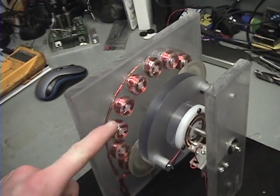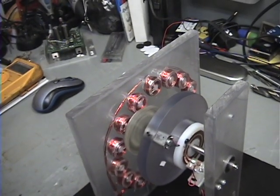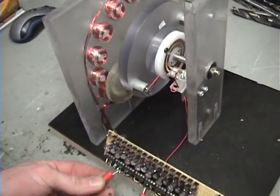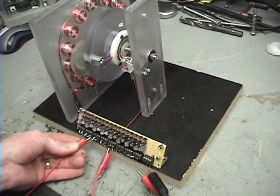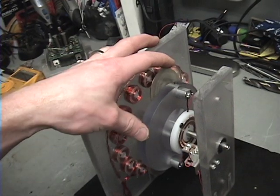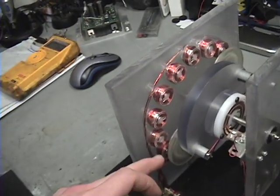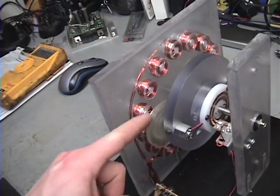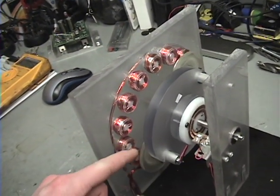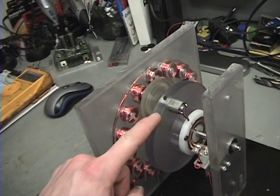Now originally when I short these coils out, this rotor would turn the way I had those magnets on there. But oddly enough, when I short these coils out — nothing. There's no Lenz's law effect at all on these coils. What that tells me is that because of the flux lines, they need to be rotating exactly with these like gear-mesh teeth. And since these are solid, they don't do that — they're just slowly rotating from centrifugal force.